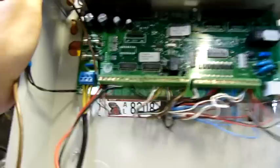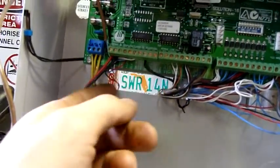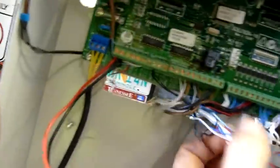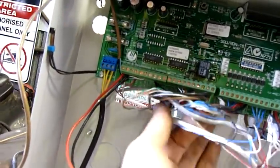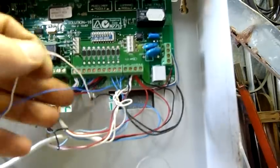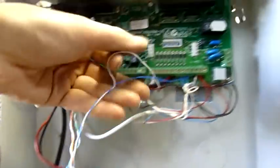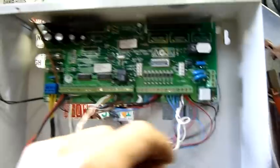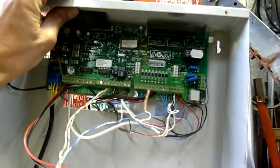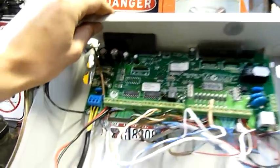Let's get this board out and have a closer look at it because it's got all the markings on it — zone, speaker, communication, data link. The ethernet cable is going to speaker and com, standby speaker, com, DC negative — and tracing it further, there's a joiner going to a black wire, which is actually going to the tamper switch. Interesting — that might be to communicate with another console as well.